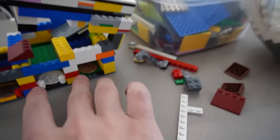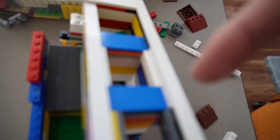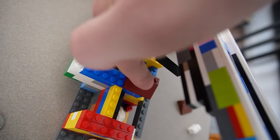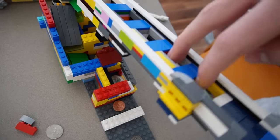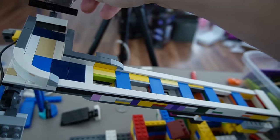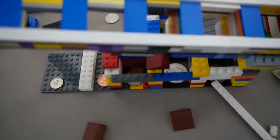I've got the bottom containers set up — there's a dollar coin slot, a half dollar slot, and a quarter slot. The half dollar falls all the way down in a spiral into the second container, then there's a ramp that puts the dollar coin into its container. The quarter just falls in easily. The ramp for the half dollar was really complicated, and I have to do a similar thing up here for the dimes, pennies, and nickels. It's working — the half dollar slides all the way around into its slot.